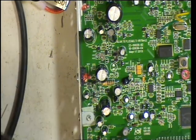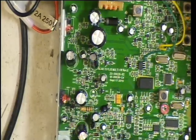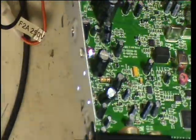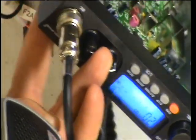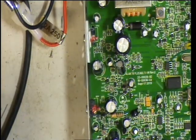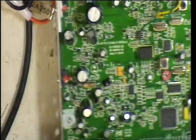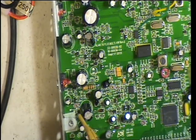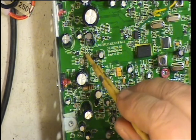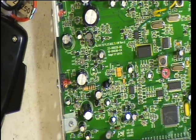That's a bit better — it's about 3.5 watts. I'll just recheck the meter on the front. We can now let it read where it says 4 — yeah, that's fine. So that covers it: we've got the transmit coils, deviation, frequency set, power here, and AM modulation. I reckon that covers it — see you on the receive side of the video.